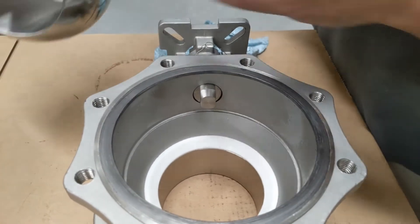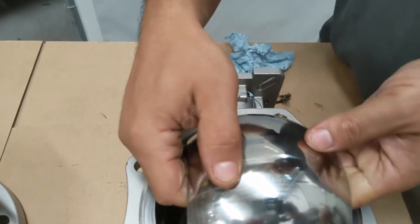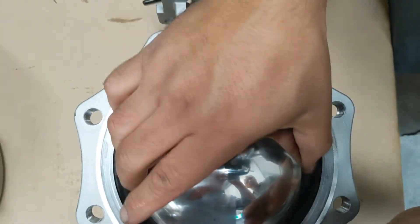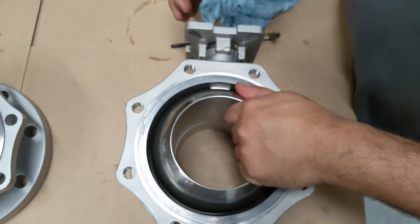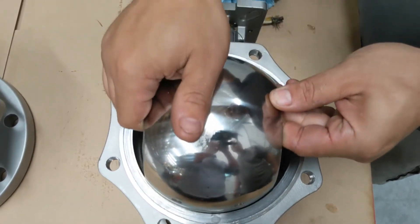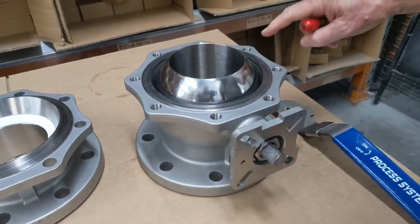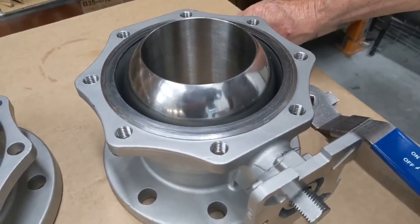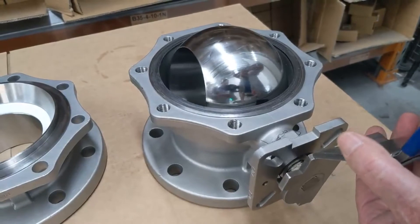The drive is facing horizontally and we slide the ball on, then we turn it so it should be seated. Now that we've inserted the main body gasket — this is the graphite impregnated gasket — and the ball is in place, we can just put the lever on to gently rotate and make sure it's all free.